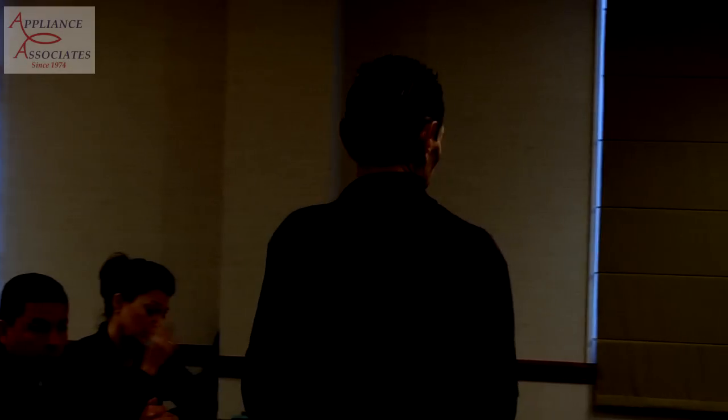Okay, so what I was saying was that the balance switch has to hit the cabinet in order to trip. Normally, our system will handle most off-balance loads, but sometimes you get a big comforter, big bedspread, somebody's overloaded, and it's clustered together, and now the machine will start bouncing back and forth. So when it bounces and trips the switch, it starts the distribution process over again.